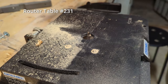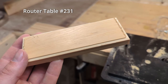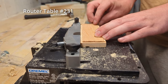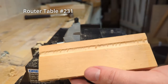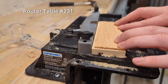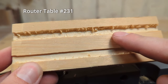I suggest using the plastic guard which is there to protect your fingers — I'm showing you without so you can see better how it works, but be careful. To make straight lines with the routing table we use the fence, set it to our preferred position depending on where we want the groove, then pass the piece of wood over the running routing bit while holding it up against the edge of the fence. I suggest doing shallow passes since the bit has a tendency to wander or make tear outs in the wood if your passes are too deep. Even though this attachment is a little bit clunky for setup, it really is useful and I will use it for many projects in the future.